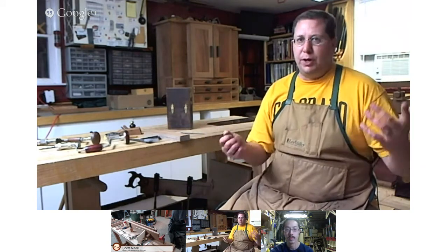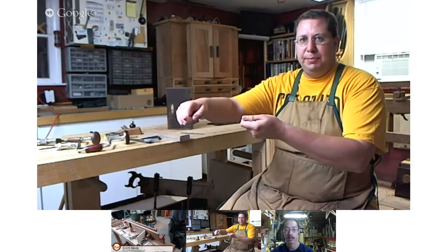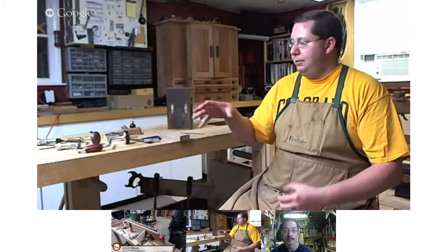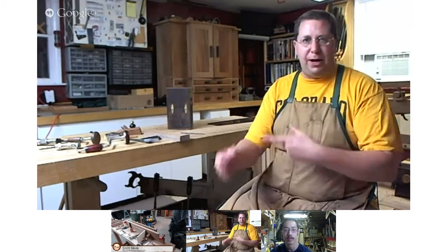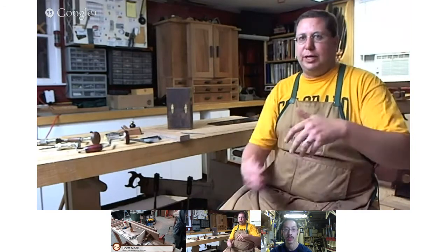When working with a bow saw, or cutting curves with a fret saw or coping saw, it's always a good idea to be sawing while you make the curve, because that way the teeth are not binding. Because that spoon bit presents a uniform cutting edge throughout the rotation, you can turn right away. You don't really have to do it gradually at all.